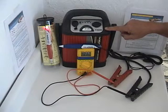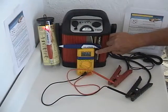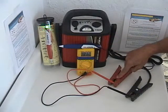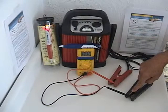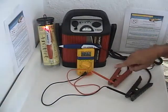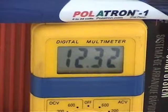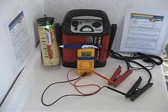We're going to connect it to a voltmeter. The voltmeter positive hooks up to the power supply positive, and the negative hooks up to the negative power supply. We read the voltage — it reads 12.32 volts. Pretty healthy power pack.